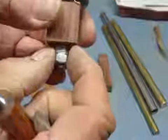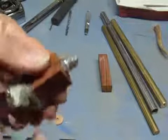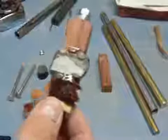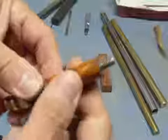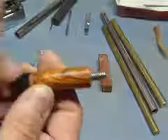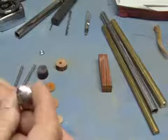And you put this in your drill. Go ahead and turn it out on the little belt sander, just like Adirondack Wilderness Company does. As soon as you get it turned out, you can go ahead and put it in a drill press if you have a drill press. If not, leave it in the drill. Spin it up. Start it out like 150 grit, 220 grit. Go up to 3, 4. I believe this here, I polished this one here up really good. And I can't remember if it was 5,000 grit, I think is what I was using on this here. It's real fine grit. But it came out really nice. And then I use a buffing tool too, especially on the end.